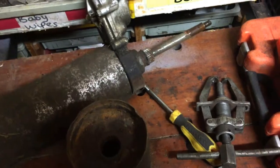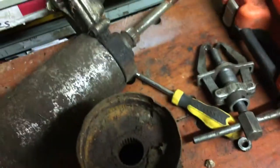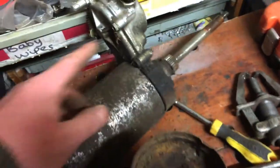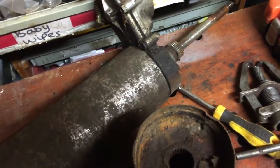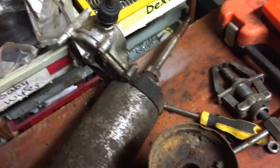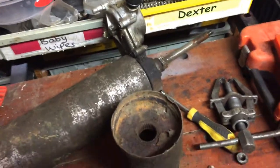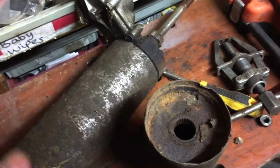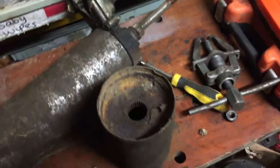There's a lot of talk about how these gearboxes on these Hondas fail, but that's probably the main reason — if you're using them commercially they're working really hard and they're driven over gravel and all sorts. The stones get in where the roller joins and that will make the oil leak, especially on the newer ones with oil in — it will cause internal damage in the gearbox. With grease that wouldn't have been quite so bad because the grease wouldn't leak anywhere near the same as oil. But oil gives you a much smoother gearbox. If I replace them now I'd put oil in because grease thickens up and gets stickier as it gets old, making the gearbox sticky.